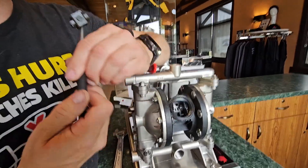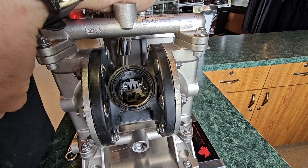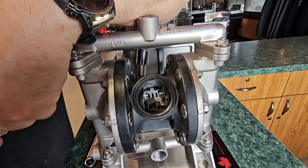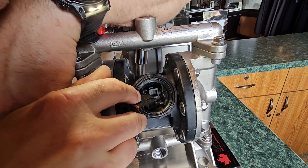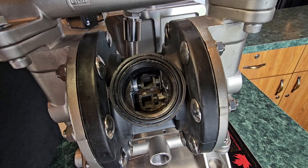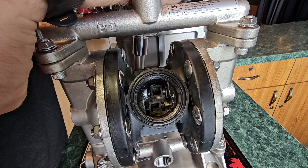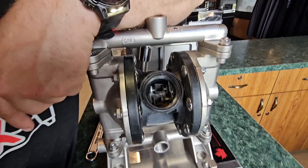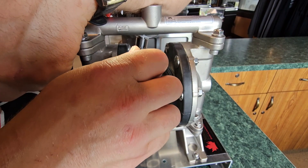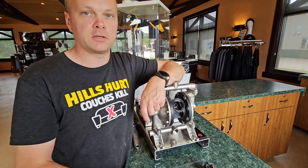Those should always be lubricated — you'll see there's a white lithium lubricant in there. It's probably food-grade, but honestly it doesn't have to be, because this is on the side of the pump that has no access to the syrup. You should be lubricating these pumps at least with air tool oil. Better yet, take this apart once in a while and put some grease on the prongs. For how little use a filter press pump sees in a normal application, though, going in there and adding grease isn't usually very advantageous. Air tool oil helps a lot — just take the cap off, remove the actuators, wipe some grease on there. Really the best maintenance is to put a couple of drips of air tool oil directly into the air port when you're using it regularly.